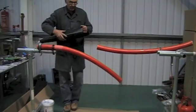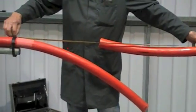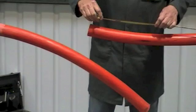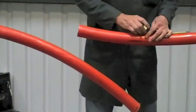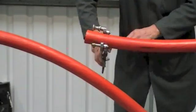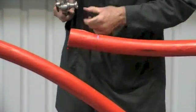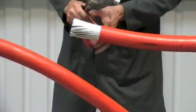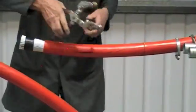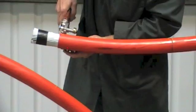We're going to show you the installation of a heat shrinkable 3 core 11kV XLPE joint. Make sure you study the installation instructions supplied in the kit, and using table 1 and figure 1, mark out the outer cable jacket. Using a suitable tool, score the outer jacket and remove as shown.